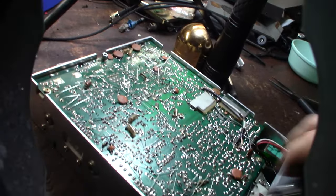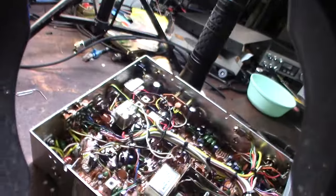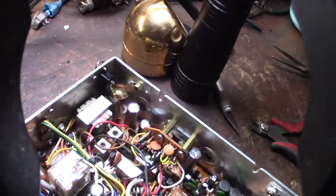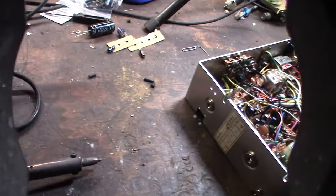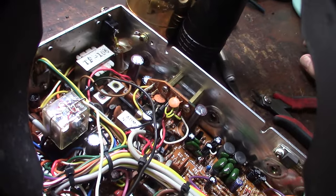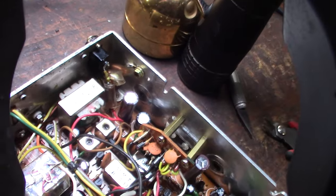So, I'm going to cut all things off, but a couple of the spots, like I said, I looked at the schematic. I got the 1,000 microfarad right here, and then this also went here. The guy had a 100 microfarad in here, whereas I was short a capacitor. I'm like, where's my 100 uF capacitor? So I thought he'd forgot a capacitor, but then I looked at the schematic. Well, I looked at the areas where I know it was custom done. So there was 100 here, and there should have been a 33, so 33 and 33.